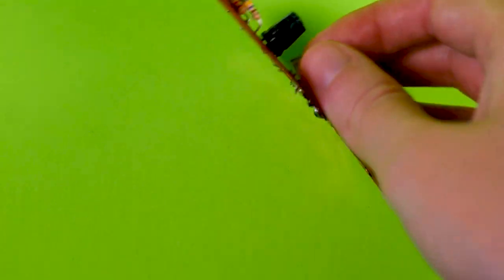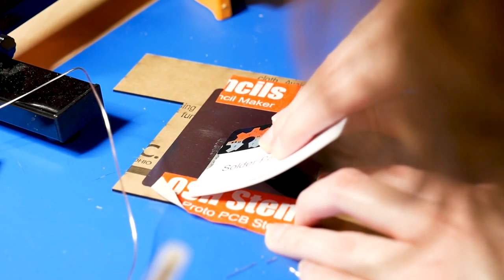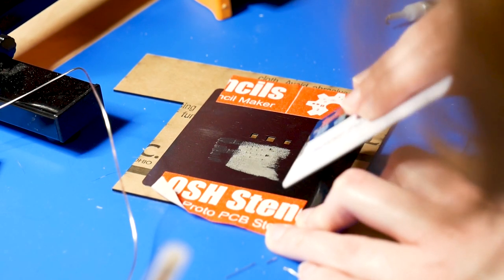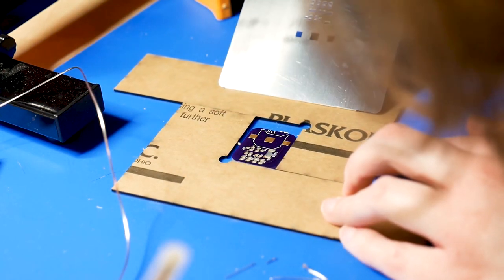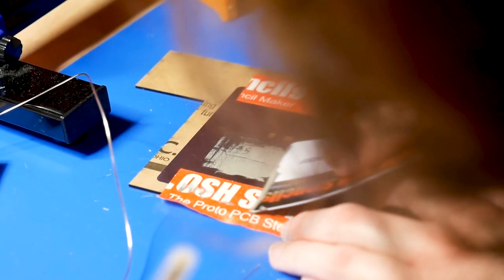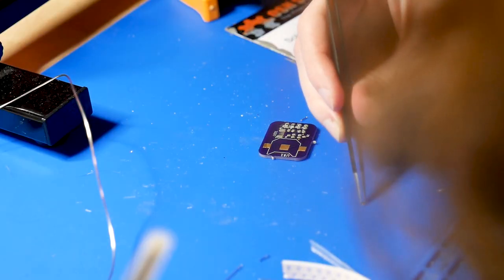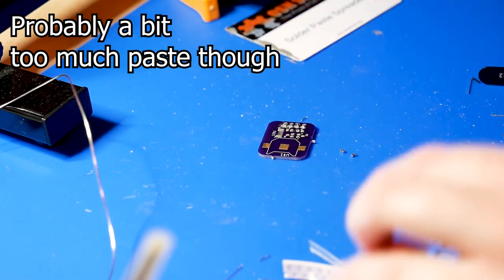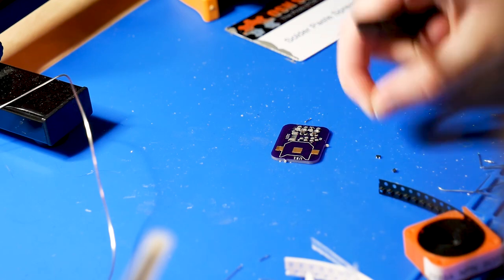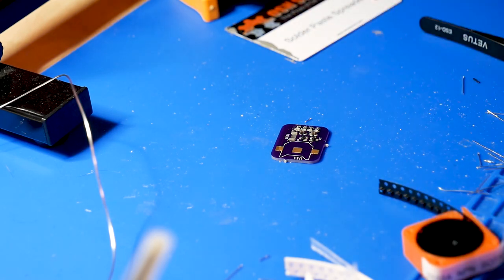It's also the same circuit that I used for the paper circuit soldering project over the summer. So this was also my first time applying solder paste, and my first spread was a little bit off — not quite fully on the pads. So I scraped that off, and I'm glad I did because the second application went a lot better. Placing the components though was stressful. You had to kind of drop them so that they didn't smear the paste, and I was already kind of nervous. My hands were shaking, and I honestly was starting to worry that the Easy-Bake Oven wouldn't be the only variable in making sure these boards worked.